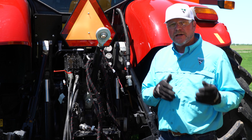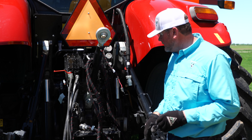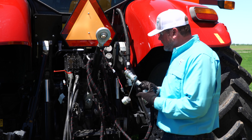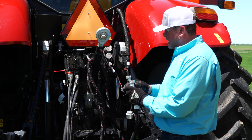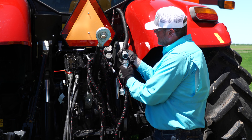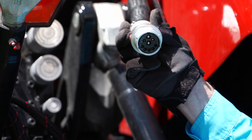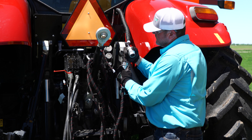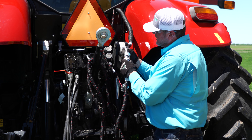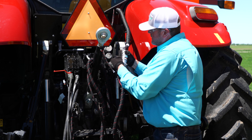We've got our cables coming here to the battery. Both the red cable from the monitor and the red cable from the net hoist are going to be tightened and connected to the positive side of the battery. We want to make sure we get these really good and tight and that the connection is clean. The black cables from both the monitor and the net hoist go on the negative side of the battery, and same thing here — we want to make sure this connection is tight.